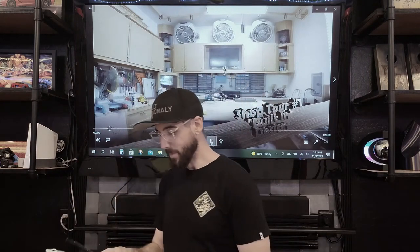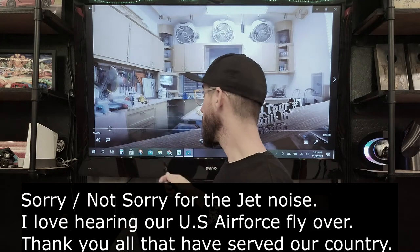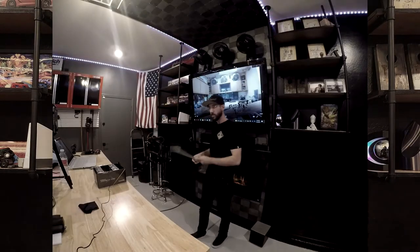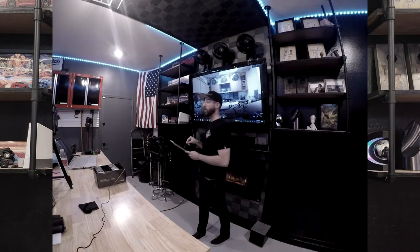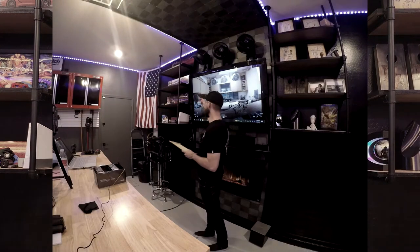In this shop it was a really complete package. The obvious pro is that this is custom, so you are building everything to the exact function of your needs and you can optimize every square foot. I love the analogy of a tiny house — everything has three uses. Custom fits your needs and you can build it yourself for cheaper. You can pick and choose the materials you want. This was primarily two-by-four and three-quarter particle board and half-inch particle board. I did three-quarter on all the base and half-inch on everything upper to be a little more light duty.